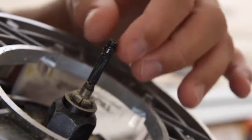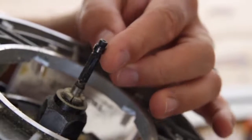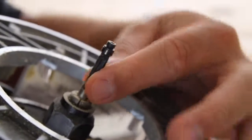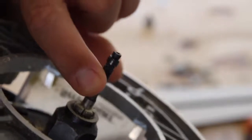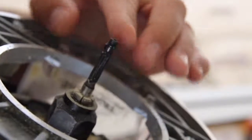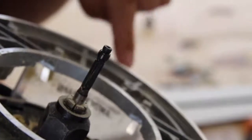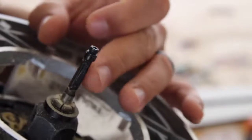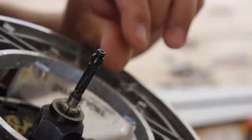Because my router bit was not long enough, I had to finish the cut with a second bit. After cutting with the jigsaw, I went back with this bearing-guided router bit — the guide bearing followed the cut made by the first bit, and the portion of the bit below the bearing cut the remainder that I couldn't reach. In my case I needed both bits, but if you have a longer router bit for the initial cut, you won't need this.